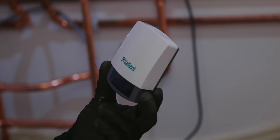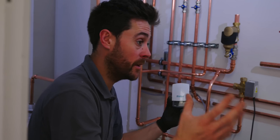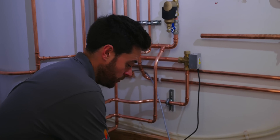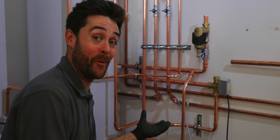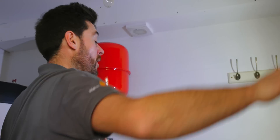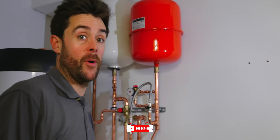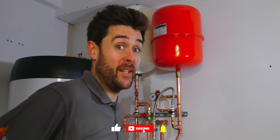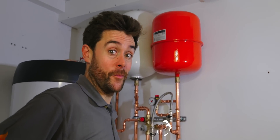Importantly, this is our RF outdoor weather sensor. This is going to provide the system with information to run on weather compensation. Managing my own expectations, if the buffer doesn't turn up I'll have to do other tasks this afternoon. I'm hoping to be somewhere near filled up and ready for this to fire by the end of the week — we're currently Wednesday, so two more days hopefully.